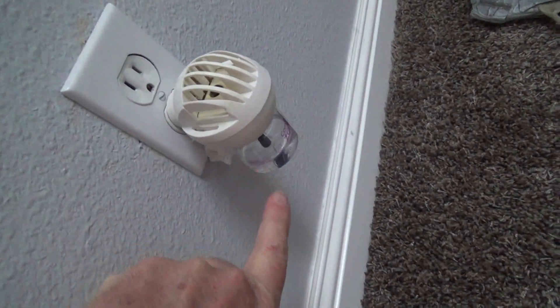The white wires always go on one side. Have you ever noticed the left-hand slot is longer than the right-hand slot? The left-hand slot is for the white wires. You turn it on the side — these are silver screws. Silver screws are for the white wires. Gold screws — on this side they're gold — that's for the black wires.